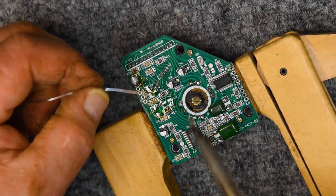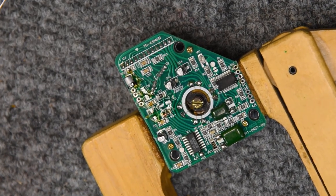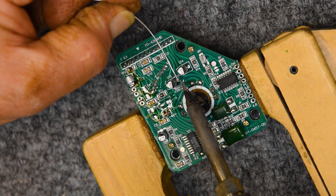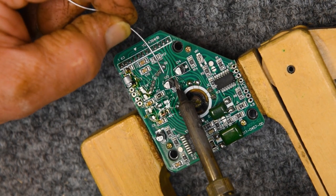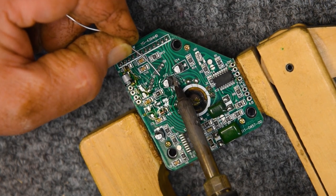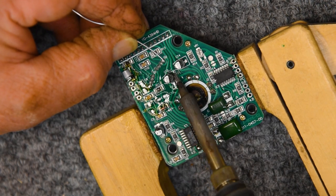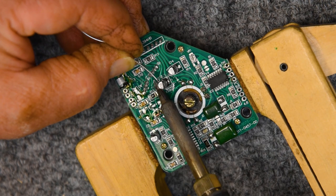This is a good board. The traces are not damaged badly. Some of them are very corroded, and they've gone a long time in that condition, and everything is risky on those, and the chances are that I'll probably be repairing something or doing something to make up for the damaged pad. It's just part of the procedure. You have to be prepared to deal with and repair traces and pads.